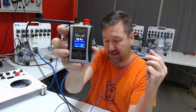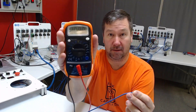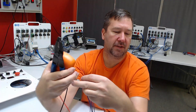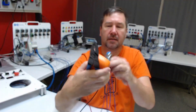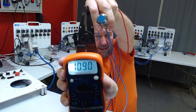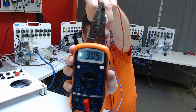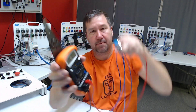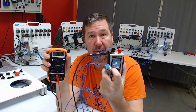I have my meter at 10 volts, and now we can see that we're getting a signal. It's showing roughly 11 milliamps right now — roughly 10 or 11 milliamps. And as I get it closer, because this is inductive, you can see it goes down. So here I can test this sensor and make sure it works simply by using a portable power supply.